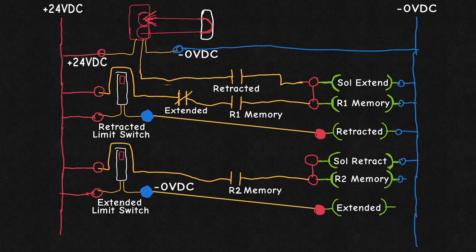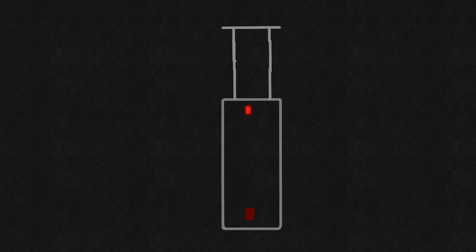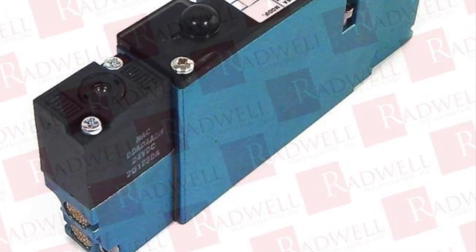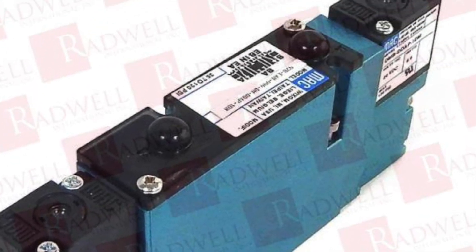If, when the retracted sensor is active and the photo-eye is still blocked, it will jump out again and again until unblocked. These relay logic circuits are simple and made with salvaged equipment, so I don't pay industrial prices for having an amusing device.